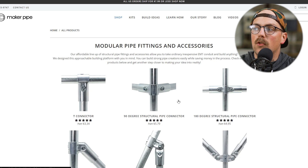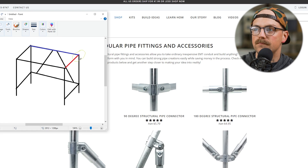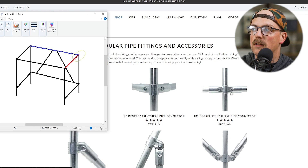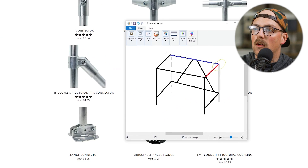We've got those four options for joining three pipes together. So if we go through and look at the options and compare what we need in this build — let's look at the 180 degree: we've got the pipe that goes all the way up through the middle, the vertical black pipe in our sketch, and then one pipe coming in from one side, that would be the blue one. But then if we have another pipe coming out on the other side in a straight line, that's not what we need here — we've got a pipe coming in at a different angle. So we know it's got to be coming in at an angle; let's look at the 135 degree connector.